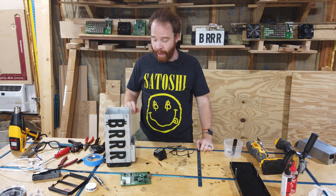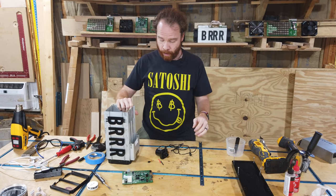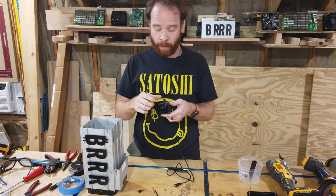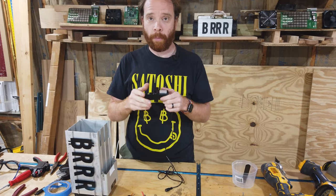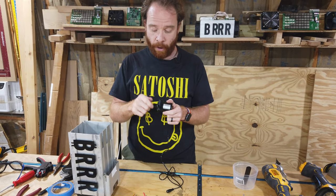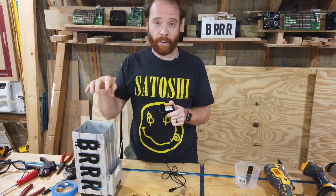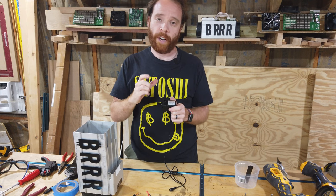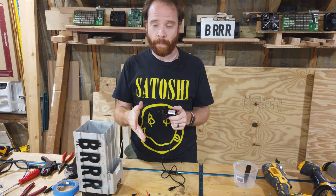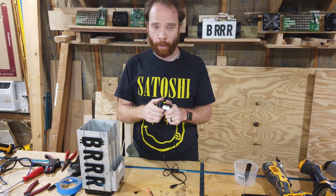All right, so now that we have mounted our injector plate to the casing, we want to work on our pump. Now, we are using regular submersible pumps. The only thing you have to check for is that they are rated for more than 60 degrees Celsius, because the oil actually gets more than 60 degrees. So in our experience, we used some pumps that will shut off when they get too warm. This one is rated to 100 degrees, and it will continue to work.